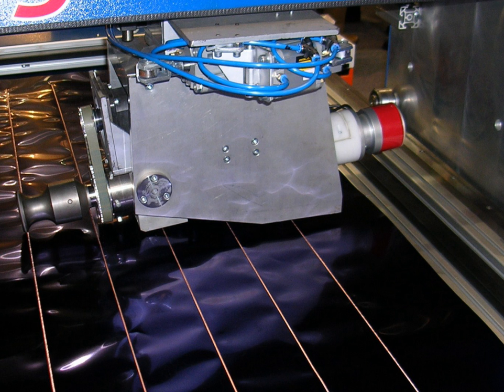Ultrasonics can also be used to weld metals, but are typically limited to small welds of thin, malleable metals such as aluminum, copper, and nickel. Ultrasonics would not be used in welding the chassis of an automobile or in welding pieces of a bicycle together, due to the power levels required. Ultrasonic welding of thermoplastics causes local melting of the plastic due to absorption of vibrational energy along the joint to be welded. In metals, welding occurs due to high-pressure dispersion of surface oxides and local motion of the materials. Although there is heating, it is not enough to melt the base materials.